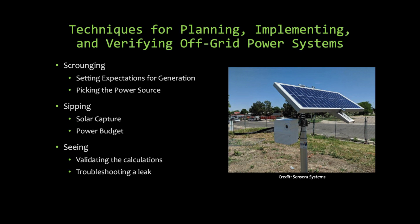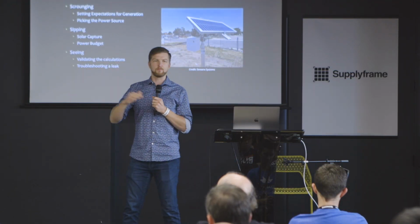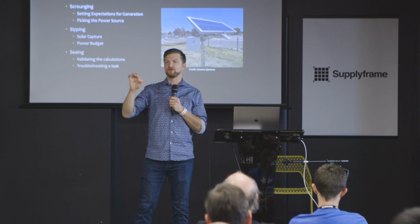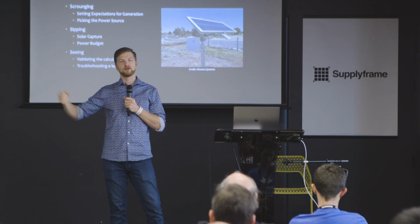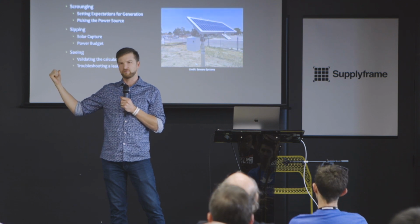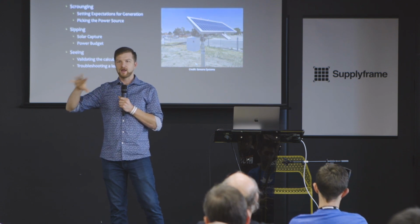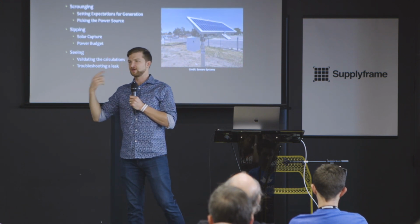The big thing to remember here is it's architecture. It's all about architecture. If you have a bad architecture, it doesn't matter how nice your switch mode power supply system is running. I don't care if it's 98%. If you've got another chip in there that's consuming a milliamp all the time with no sleep function, it's game over. So you have to make sure that as you're picking things out at the beginning of the design phase, you're getting it right.